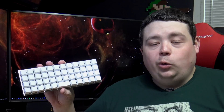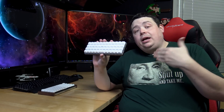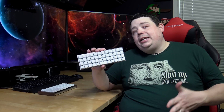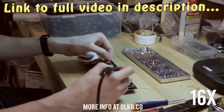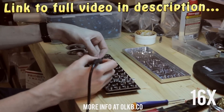The first nerdy thing about both of these keyboards is that they come as a kit, which means you have to assemble it yourself. When you order either keyboard, it comes with the back plates, the front plate, and the Prionic comes with the wood ends on it, all of the electronics inside. You get to pick which type of switches you want — I selected Cherry MX Blues because I love that switch — and you get to select what key caps you want. I kind of wish in hindsight I had ordered the kit and assembled it myself, because it turns out you just drop the switches through a PCB and solder each pin in place. The pins are far enough apart that you don't have to worry about over-soldering or shorting things unless you really suck at soldering.